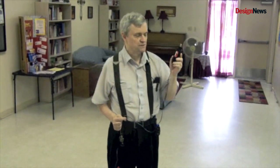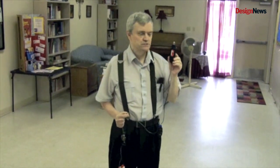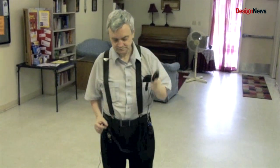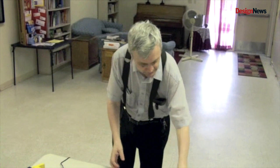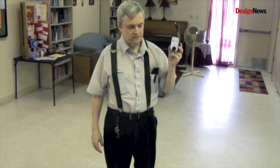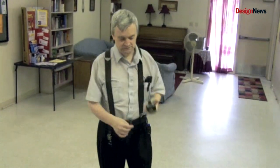It's a whole lot handier to use than a big AC power tool, but for precision work, you definitely need the speed regulator. This thing screams at high RPMs when unloaded, but slows to a crawl when you put a load on it. I solved that problem years ago by designing an electronic motor speed regulator based on the 555 timer chip.